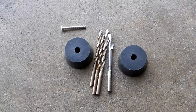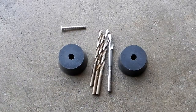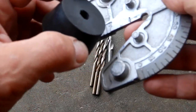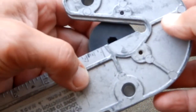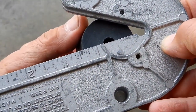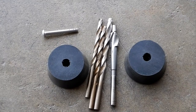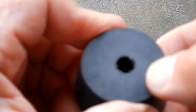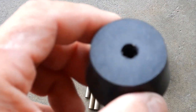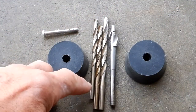Here's what I had to do to modify these rubber bumpers. To start, I took a centering tool, held it up to the bumper, and made multiple marks while rotating it to find the center. I did that to both bumpers. Next I had to drill holes. This is rubber — it gives. I did this on my drill press, and you'd see that when you drill rubber it expands out, unlike wood or metal.